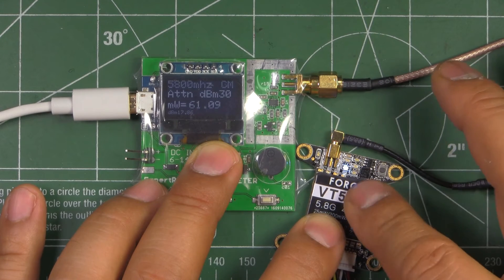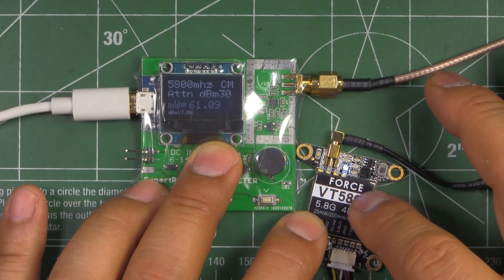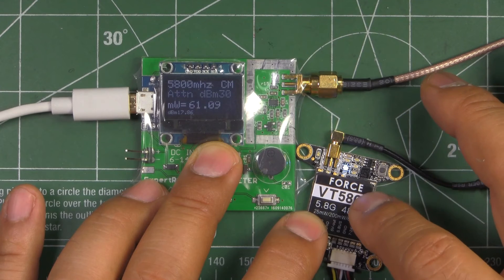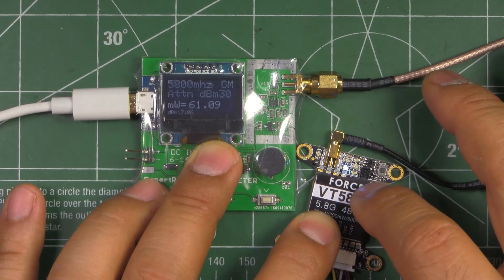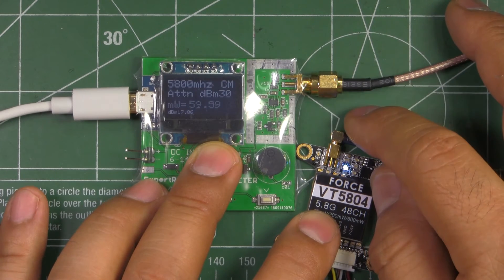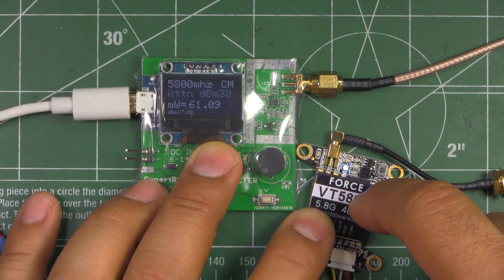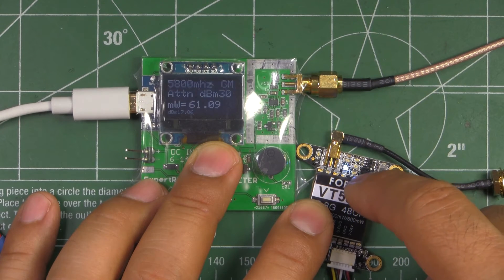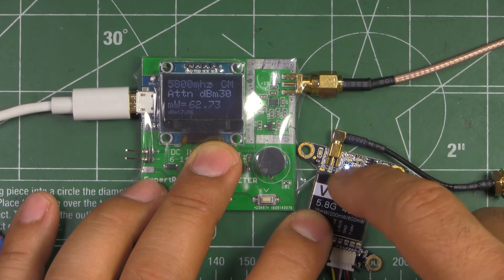If you're in a race with a lot of people, not having a true 25 milliwatt output — I don't think it would make that much of a difference going from 25 to 60 milliwatt. It's a little more than doubling the power, but as long as the channel separation is good on this transmitter it should be okay. The most important thing is that the channel separation is good — no spill from channel to channel.